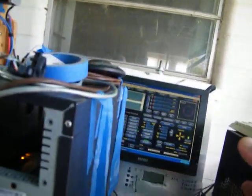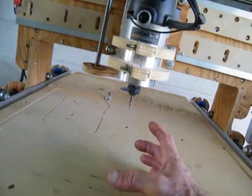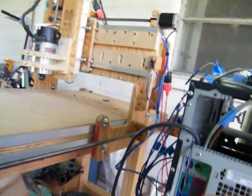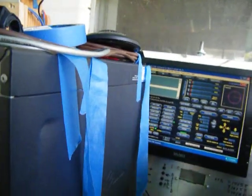The only issue I'm having right now is the size. It's actually supposed to do a 4-inch circle and this thing's like 8 inches. I drew it with BobCAD. There's a little difference in the way the servos are set up on that one over there — it's got timing gears and timing belts, so I'll have to go over and measure those and count the teeth to figure it out.